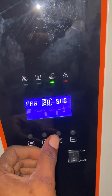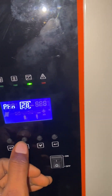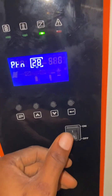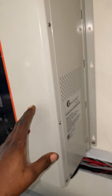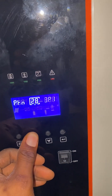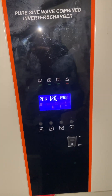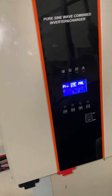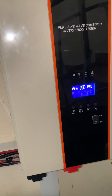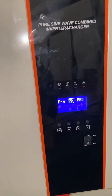The one you set last will be the slave. This one is still on single, so I want to parallel it. To do that I press here — it will start blinking. I press up but it won't function until I switch it off, just the way I did on this one. Once you switch it off, you can carry out the setting. Put it to parallel — press here, the setting will enter and start. Then you can leave the screen to go off on its own. It's on parallel now — we have 20kVA.